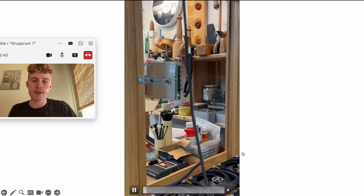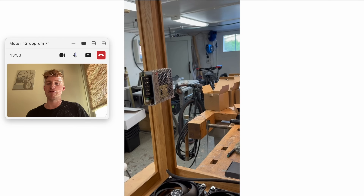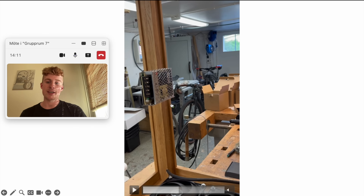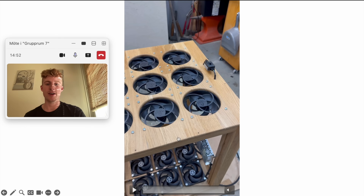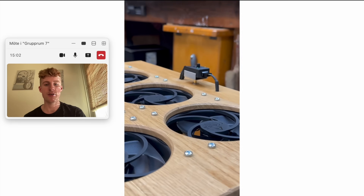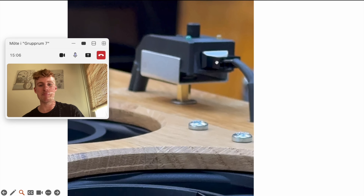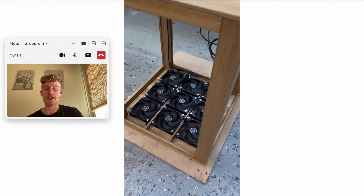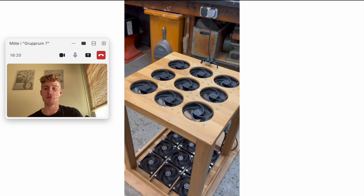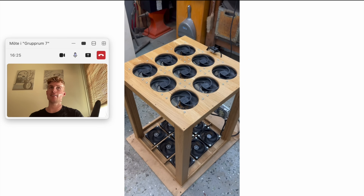How did you power the unit? Here's a video of when I installed the driver into the unit. I needed to convert the electricity that goes into the unit to 12 volts, so that I would be able to plug it into the wall and just turn it on. So that's just an ordinary Meanwell driver — it's just one cable out of the unit, and then it's just a plug. And here you can see how I made a small clip out of aluminum that clamps the controller. Having a fan controller in a design like this with PC fans means you can run it at very low speeds, which makes it very, very quiet. I can stand right in front of the entire unit when it's up and running, and I barely hear it. What that also enables is that I could crank it up and clean the entire place in a very short amount of time. So that controller actually makes the entire unit more flexible.